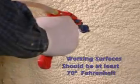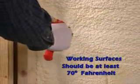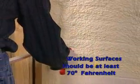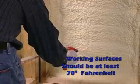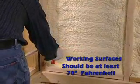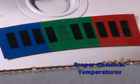Was the target surface warm enough? Surface temperatures below 70 degrees Fahrenheit will diminish the amount that the foam rises, and will yield less coverage. To get maximum coverage, make sure that your working surface temperature is at least 70 degrees Fahrenheit. Were your chemicals in the proper temperature range when you were using your kit?